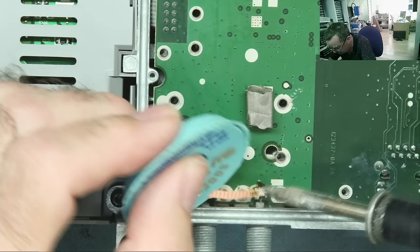Okay, what do we have here? So, thinking if it's possibly PNP here. That reads, I'll show you, 1.8 volts. What about this one? 2. Go the other way. That reads like a transistor. That doesn't. Are these devices identical? Let's have a look. Yeah, so these are both marked L8, and then the funny something or other in 4.2.